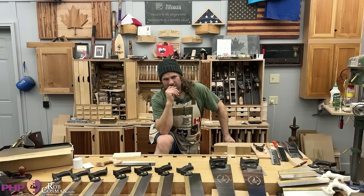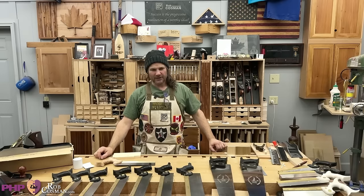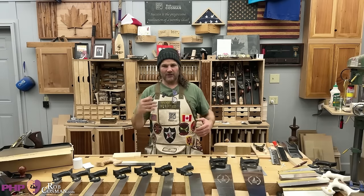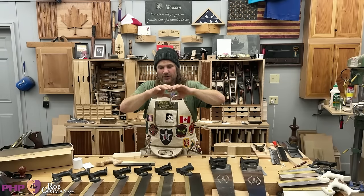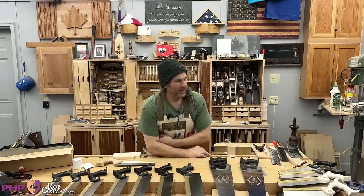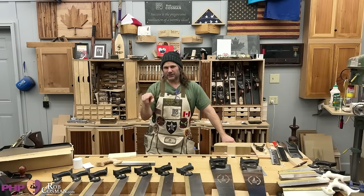He said he's cutting 2 strips of 4 feet. Needs to make a 6-foot piece. Yeah, I know, but I don't know how big the piece is. I mean, if you're trying to do 2 little skinny pieces and make a long piece, it's going to be a little bit tougher. If it's fairly wide, commercially they use a finger joint, so you have a long tapered joint that gives you lots of glue surface and makes for a really strong joint. In fact, usually under those circumstances, the piece of wood will break somewhere other than the actual joint. You're doing it by hand. That would be a task, but possible. I don't know how much stress you're going to apply to it.